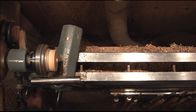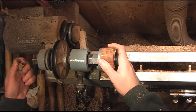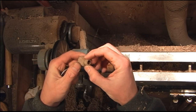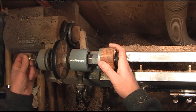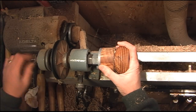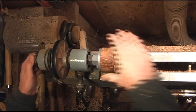I'm going to run it right back on. What you do is just slide it through your headstock, screw it on — this is just a small face plate chuck I had. Turn that little knob there and it slides right in the headstock. Inside there, just put a washer on it and tighten it up. Then you take your work piece, slide it over it and tighten it down.